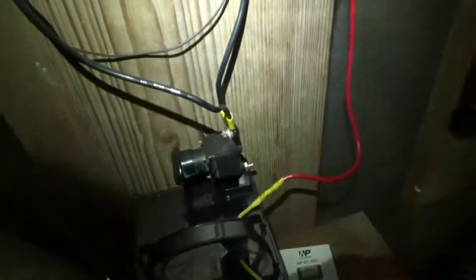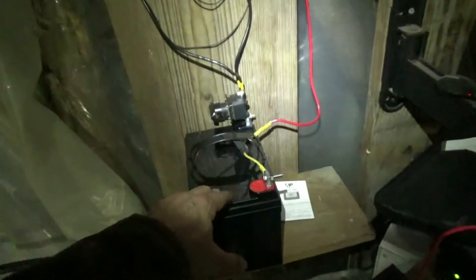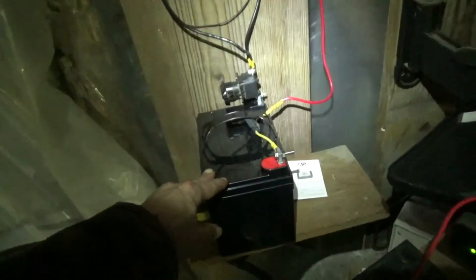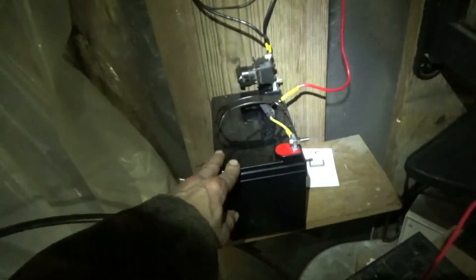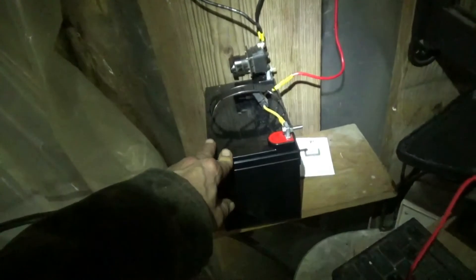I also have a master on/off switch so I can turn power to everything from the battery off in one click. I'm not going to do that right now because the Pi is actually running. This is a 35 amp hour, 12-volt AGM type battery. AGM stands for absorbed glass mat — it's not a liquid electrolyte battery. Instead they take a fiberglass mat and absorb the electrolyte into it. These are much more durable for charge and discharge, depth of discharge, as well as long-term discharge scenarios.